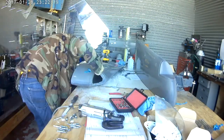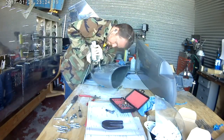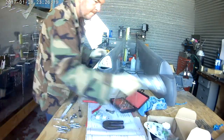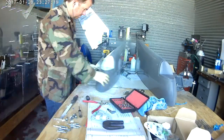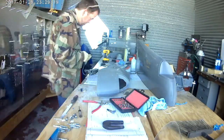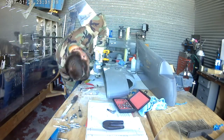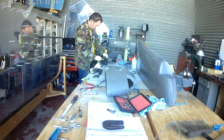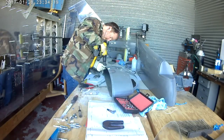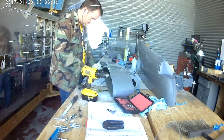You really can't set that rivet into a nut plate — there's one nut plate on each side of the lens. You can't set it with a rivet gun; it makes me nervous. And you really can't set it with the squeezer unless you've got that hole cut. So it's a double whammy: I need to cut those holes to get my lights on, and I need to do it to get the nut plates on. There are 42 nut plates in each wingtip.